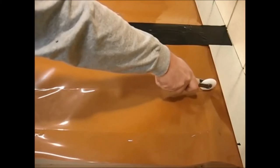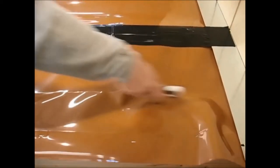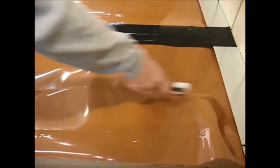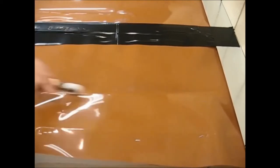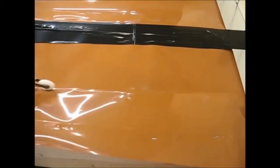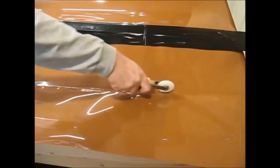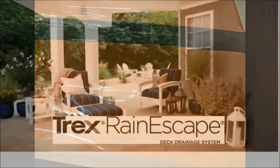Because the product is made out of polyethylene, if there's a big influx in temperature from hot to cold or cold to hot, it'll cause the product to wrinkle. If it impedes the flow of water, we recommend using a screen spline roller to roll down the middle of the sheet to create a V shape. This creates a nice straight path for the water to exit the trough.